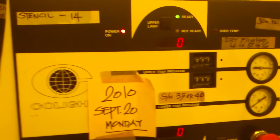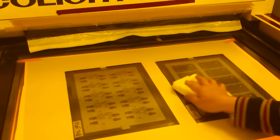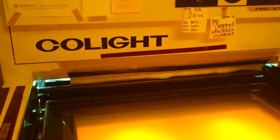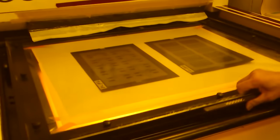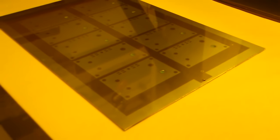We take our photoresist-coated board and accurately align our film on top, doing that for both sides. In this particular case they're doing two different panels, two different sides at the same time — just an efficiency thing. This is our UV exposure machine. They give it a wipe and expose it. You'll notice that a lot of this video has a yellowish tinge — that's because these boards are UV sensitive, so the manufacturing facility uses special lights that won't expose them. The machine closes, the UV light comes on, and it doesn't need to expose for long at all because these are real high intensity UV lamps.